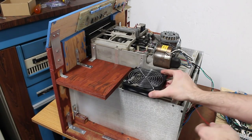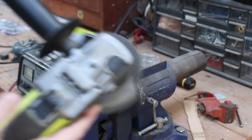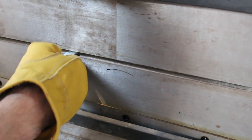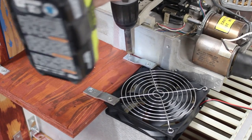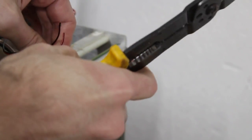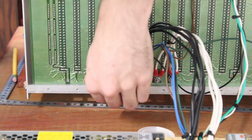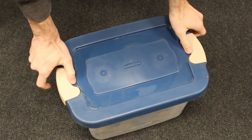With the power supply mostly sorted, let's get some cooling going on here. I'm going to use two 120mm 12-volt fans, but I need mounting brackets, so I'll give a little cut on the angle grinder, clean it up on the bench grinder, then take it over to the brake and give it a double bend to better align with the fans. To wire them up, I'll crimp the positive wires together and take the 12 volts directly off the 12-volt lug on the back plane. For ground, I solder a wire to the two fan grounds and connect that to a ground lug on the back plane.